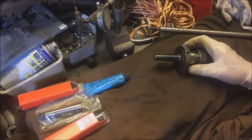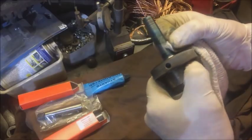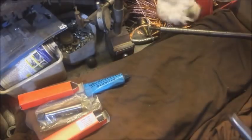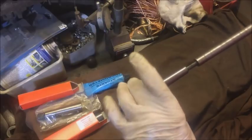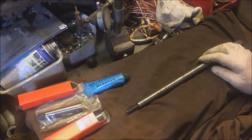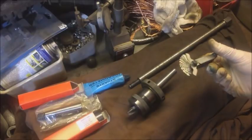On the website it says if it had been B&S — Brown and Sharp — it would have worn a clear band just around the bottom where the taper was touching. So knowing that was Morse 2 taper, I needed to know what that thread is. So that's the drawbar out of the mill — it screws in there nicely. Initially I went and got my tapping dies, but it doesn't do imperial. So I couldn't run a die over that. I do remember once upon a time coming across one of these, so I dug out my set. Figured, well, if it's an old machine it wasn't going to be metric, so I went for the Whitworth.